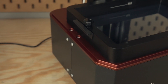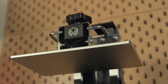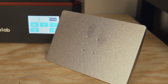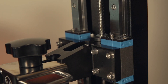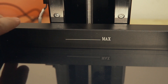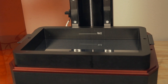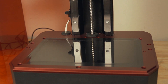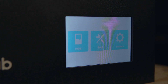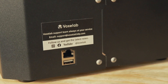With their much quicker print times and much longer lifespans, I think it's safe to say that all resin 3D printers from this point forward are or should be monochrome screens. The build plate on the Proxima is aluminum with a slant on top to prevent resin from building up, and is either sandblasted or coated giving it serious texture to help with adhesion. The build plate rides up and down on two beefy linear rails and one lead screw. The vat is also aluminum with replaceable FEP, which based on feedback seems to be heavily preferred over injection molded vats. Interfacing with the Proxima is done via the touchscreen on the front, which has the same easy-to-use Chitubox systems menu found on many other resin printers. On the right side there is a full-size USB port as well as an ethernet port.